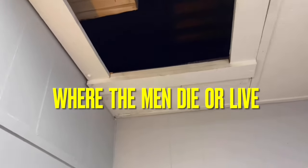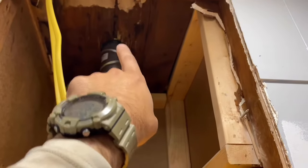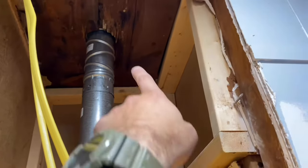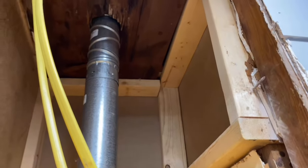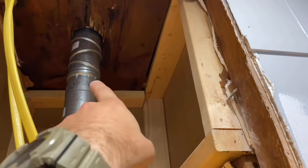I actually did have to go up in the attic space, which is just right here by the hot water heater. I went up in there and had to move that asbestos pipe over just a tad so that I could slide the three inch up into that four inch coupling. I used this fitting to go up in there, up past that, to that hub inside the asbestos pipe. But if you were using the same pipe, you just keep going connecting the pieces.